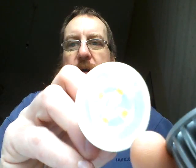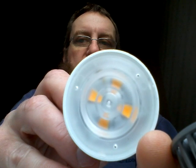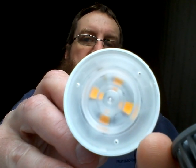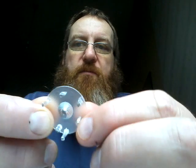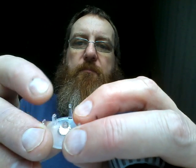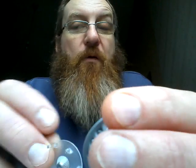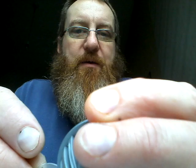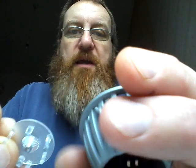The classic Philips GU10 lamp, which has quite a lot of chips in this particular one, but they're actually mounted in four separate packages with maybe a few chips in each. But other than that, I like the fact it clips together quite snugly. The circuit board is actually held in by the spring tension of the little latches on this, and it's held in alignment by extra pins on this mounting here. So it's quite a nice design. I did try shaking it forcibly without any heat sink compound in it, just to hear if there's any movement at all on the circuit board, and couldn't hear anything. So I'm guessing it probably does make quite a good thermal contact.